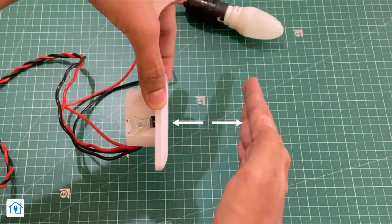If you have a LED bulb, you can use it up to 1200W. When you talk about the power supply, it operates on 220V to 240V AC at a regular 50Hz. The sensing range is about 4 to 5 cm — it can sense within this distance to perform the operation. These clips are shown; basically it is designed for modular boxes. If you have a modular box in your house, you can easily fit it into it. Once you swipe, it will turn on. Once you swipe again, it will turn off.